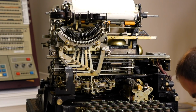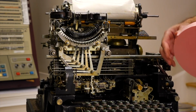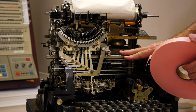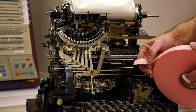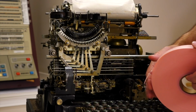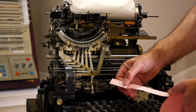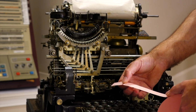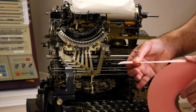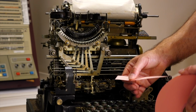So in addition to the typing or the printing, some machines could work also on paper tape. Not this one actually, but the Model 19 has both a tape puncher, which would be punched from the keyboard, and a transmitter that could separately send the tape later on. So you could punch a whole message and then feed the tape, and then some machines are able to punch a tape on receive. That's called a reperforator. We don't have that one.